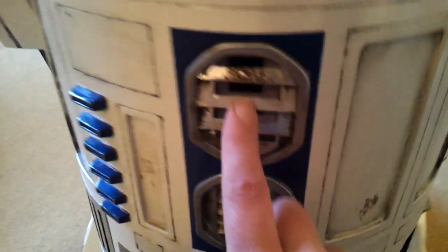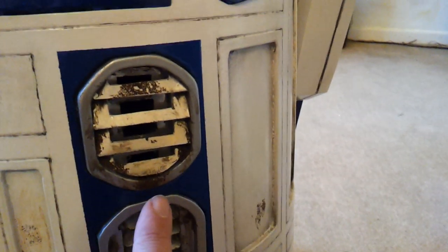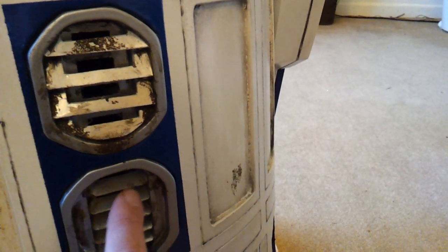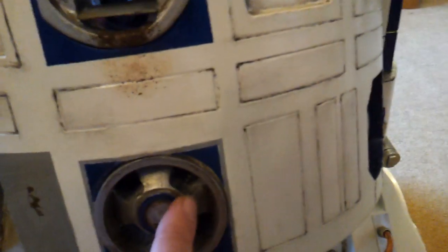These vents at the front — this housing is made of wood sprayed with a steel finish, and the internal parts are a solid aluminium plate. This is real rust on here. What I do is spray glue on the areas I want and then blow some old cast iron rust from the garden onto it — dry it and it sticks. I'll show that in another video. Around here this is MDF spun up on the lathe and gouged out. These parts take hours and hours — probably half a day's work there. These are really tricky to make. We've got aluminium plates here, again just cut with the Dremel.